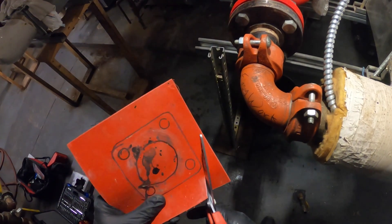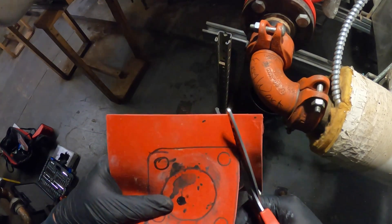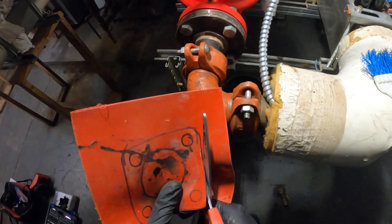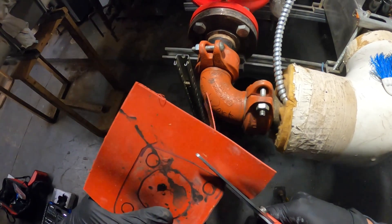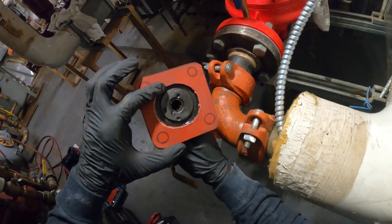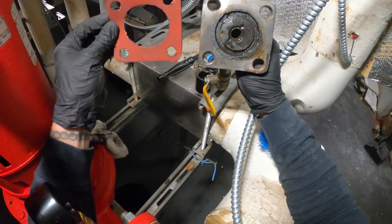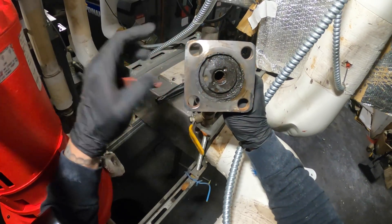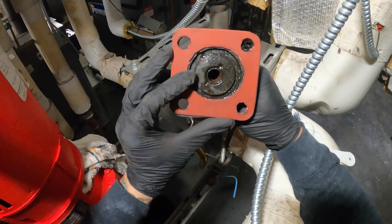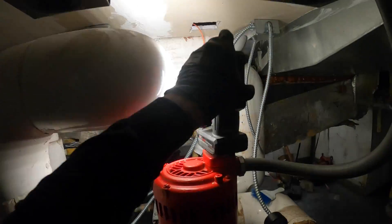We need the surface clean so the gasket can fit nice and snug. Now I'm just going to use scissors to cut around the gasket material so it fits the actual strainer cap, and then use a knife for the inside — basically just trace this out and hopefully it is good. This should work well — it's not going to be in the way of our strainer. I'll make some holes here for the bolts to go through. This is what I made right there — you really just need the area around the circle, but this way was easier and it won't affect anything. You'll still be able to get the strainer in and the bolts through. Everything was cleaned up and sanded inside there — made a big difference.